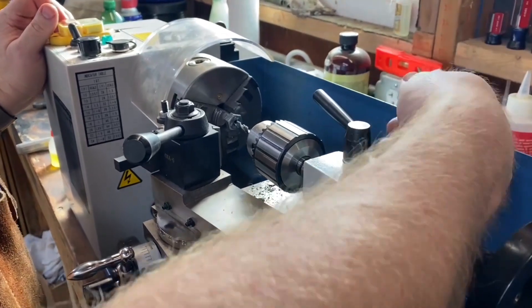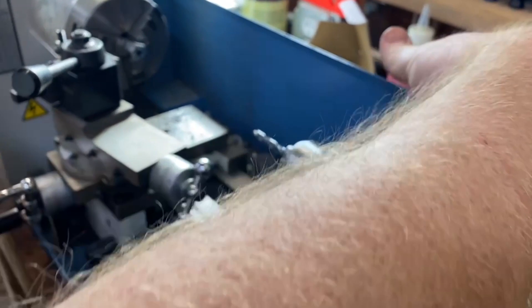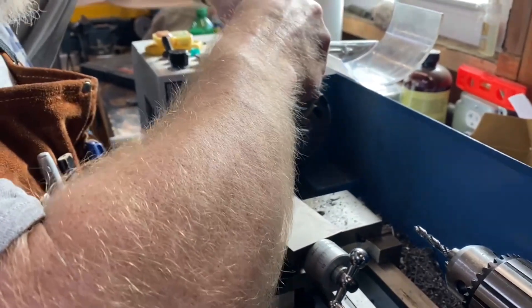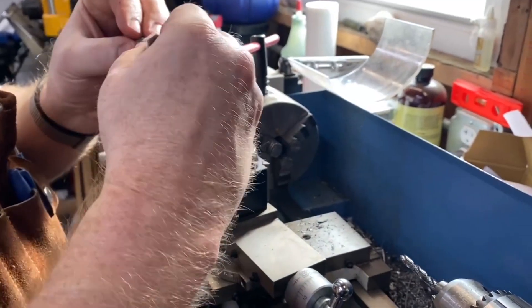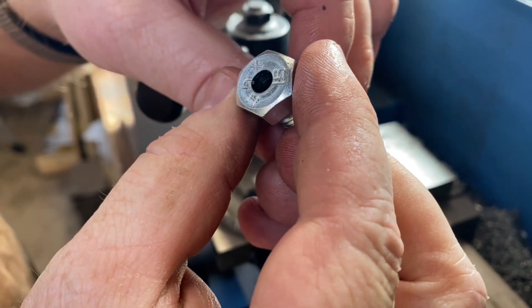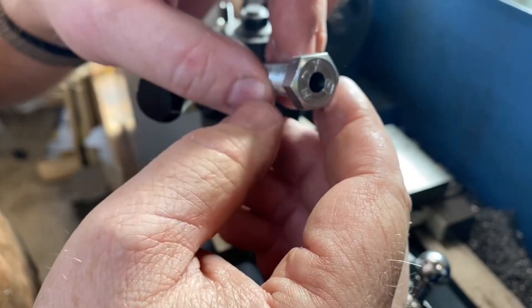We're going to take our chuck, move it out to the end and out of our way, lock it back into position, take the safety shield up, loosen the chuck, and pull our bolt out. The threads don't look bad — they didn't get boogered up. The head looks really good. Looks like a nice centered hole punched right through the center. Now all we've got to do is tap it and try out our new fitting on it.